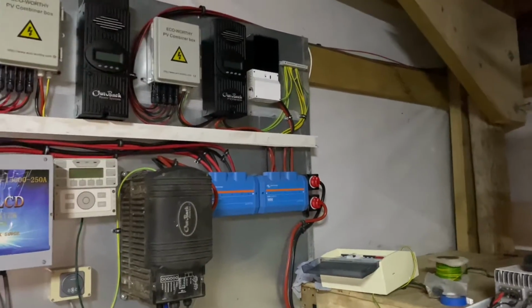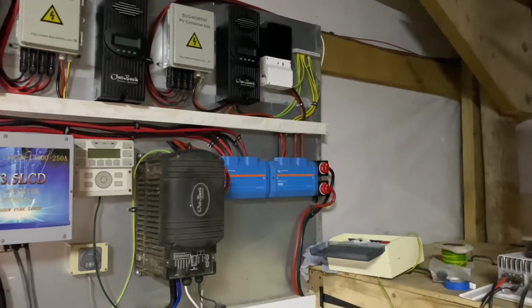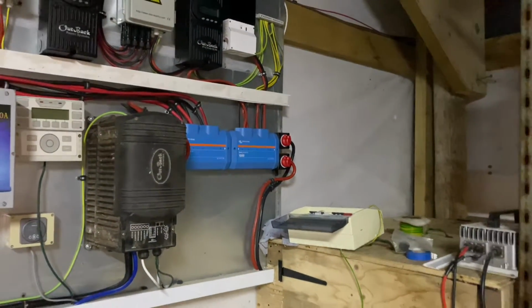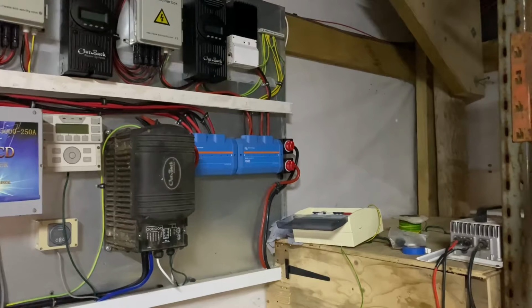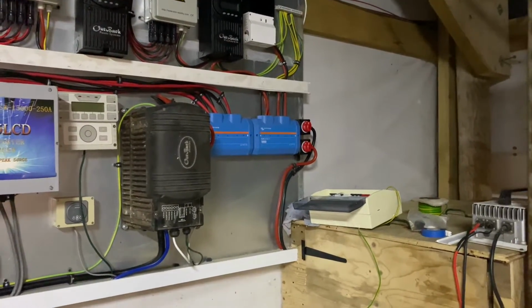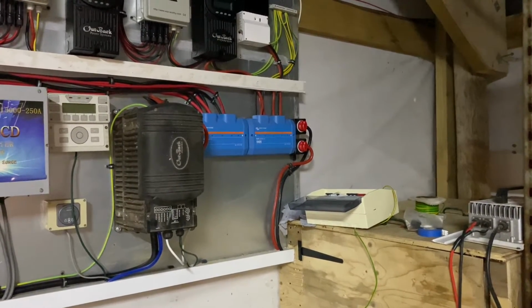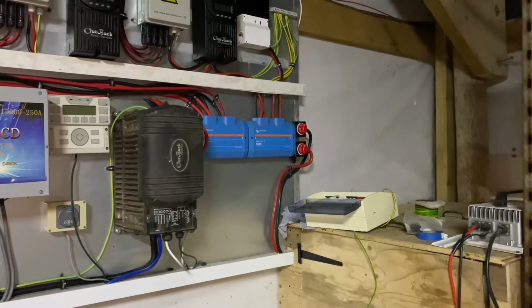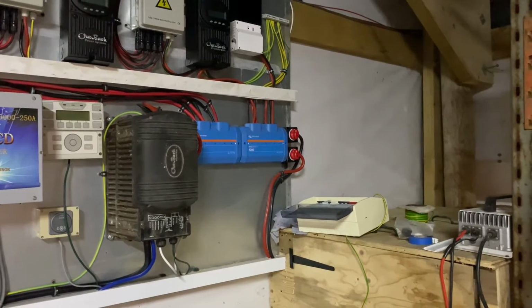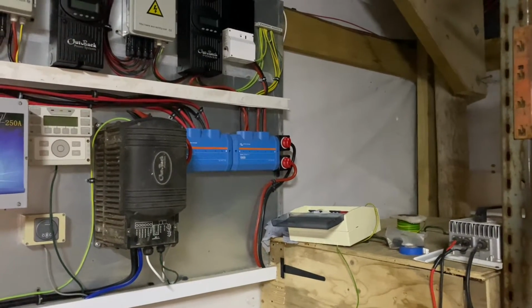But also what we're going to use is a relay driver with preset voltages. So we'll basically have 4 relays where we can send the excess power when we hit a voltage like 59 volts. The relay driver through a Cat5, like a telephone cable, will run relays in the caravan. The first one will turn the immersion heater on. The immersion heater will be a standard 240 volt immersion heater with a thermostat, so when either there's too much power for that to get rid of, or when the immersion heater turns off, then it will turn on relay 2, which will be a storage heater.